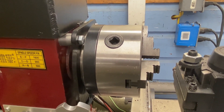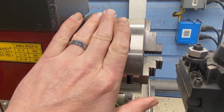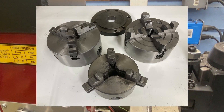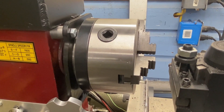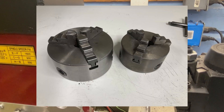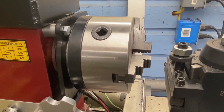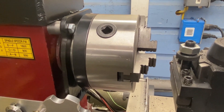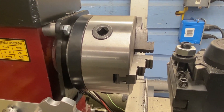This machine came with a 4-inch chuck, and I upgraded to both a 3-jaw and a 4-jaw 5-inch chuck, and this vastly opened up my ability to hold work. Obviously, the 4-jaw chuck will hold things that are irregular shape, and having that extra inch made all the difference in the world. I can fit a lot bigger material and work on a lot bigger projects.